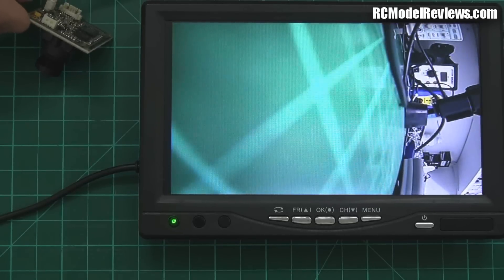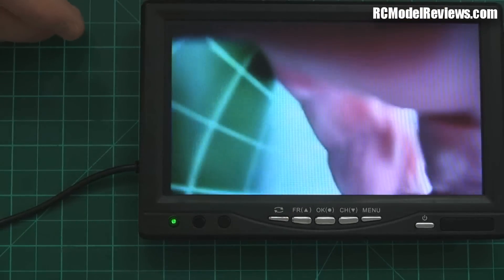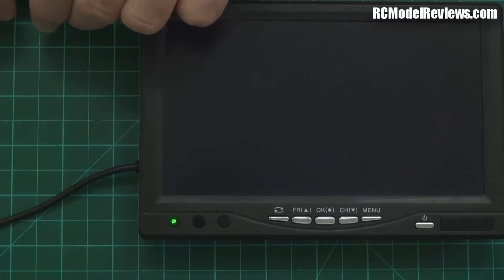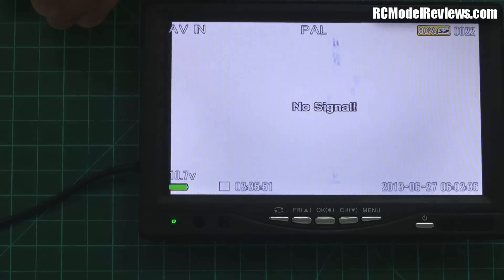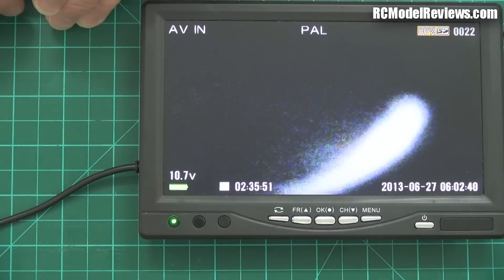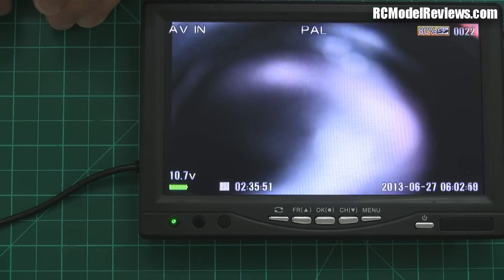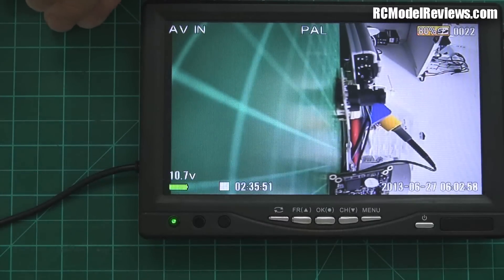Let's plug in the programming board and see what this camera offers for setup. The little programming board appears to be exactly the same as the one for 600 TV line cameras, plugging in at the bottom as usual. I also noticed that with the lens cap on, there are speckles of white noise on the screen — the amplifier gain has been wound up so high it's picking up sensor noise, which means it'll probably work really well in low light. Removing the lens cap causes a complete white overload, and the AGC takes about two seconds to fully recover.